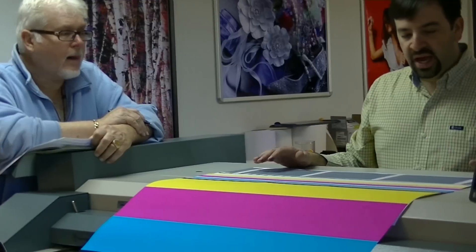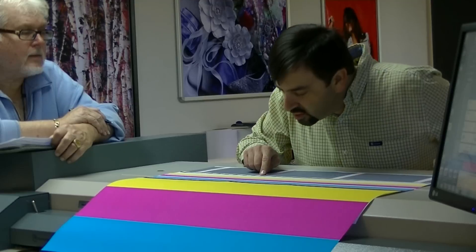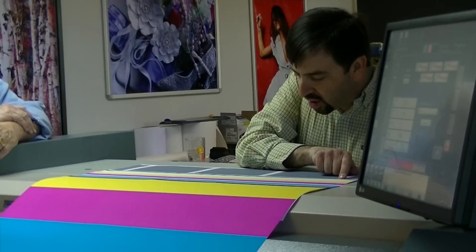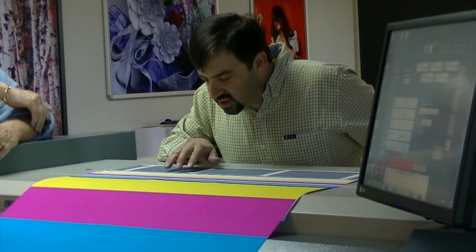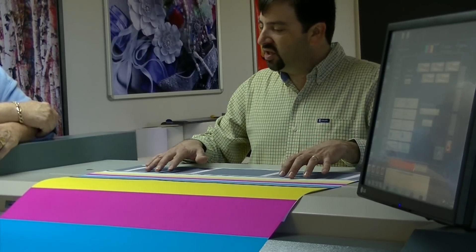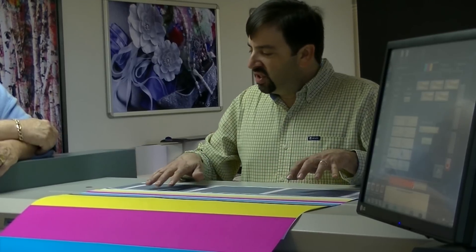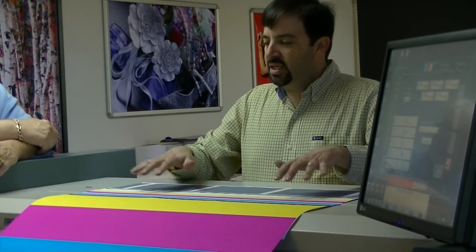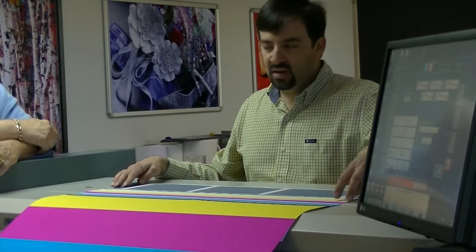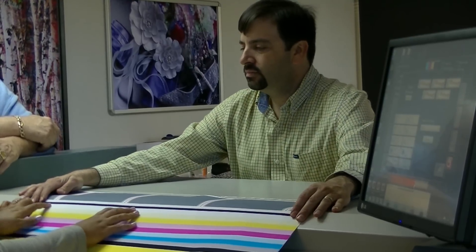You want to take a look at everything as a whole, because coming across here this seam looks off, this seam looks pretty good, this one's pretty good, and this one is off a little bit. What I'm trying to see is whether we want to adjust these two heads at the same time to get everything to line up, or if it's just one head. I'd rather — if you see an offset here and maybe both of these heads need to be adjusted down — versus trying to move this one up, this one up, and then this one up again.